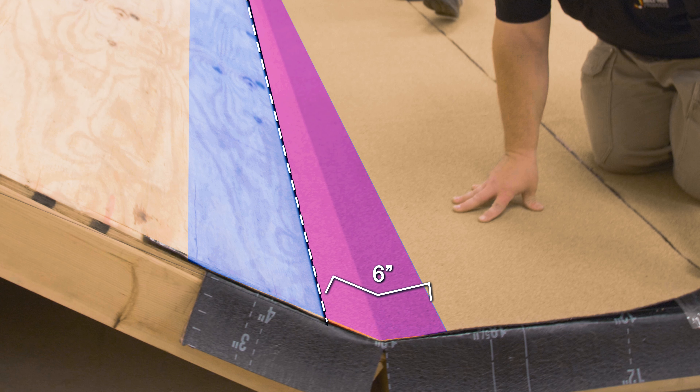Things to remember: All flashing terminations must extend vertically a minimum of 8 inches above the low sloped roof. 15 and 20-year flashing requirements are one layer of SA base and one layer of SA cap sheet. Avoid having a seam on the sloped roof. All flashings must be nailed 8 inches on center. All sloped roofing underlayment must be placed over the SA cap sheet flashing.